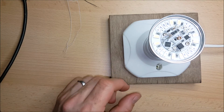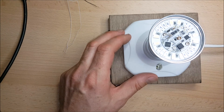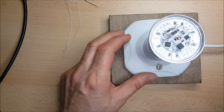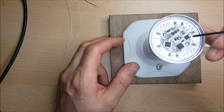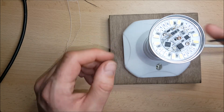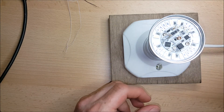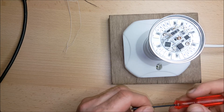Looking at the board itself, it has LEDs around the outside, it has an ESP8266 as I mentioned, and it's got its flash controller which is where it stores its firmware. Then it has a microcontroller on board — it's an LED driver in fact — which is driving the current to the LEDs. That device is called an MY9291.